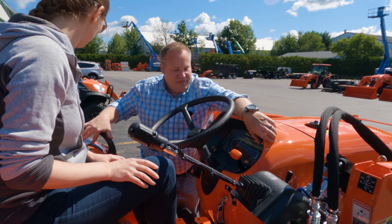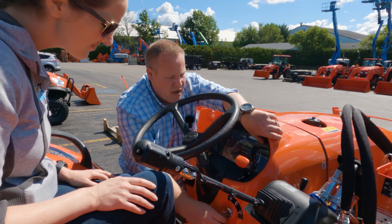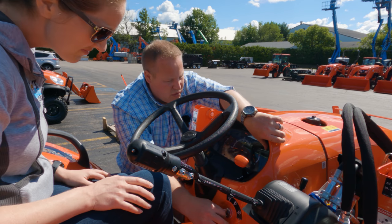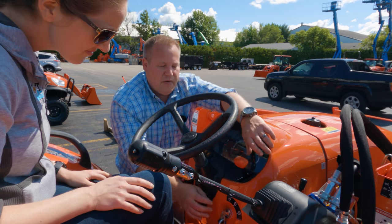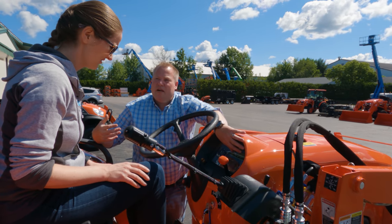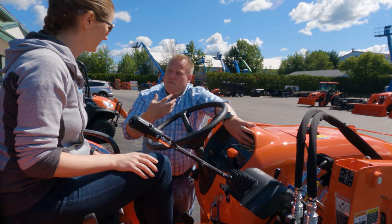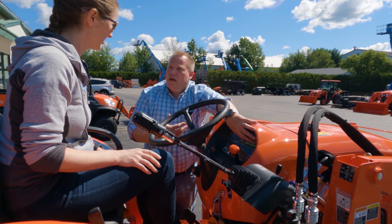When the smoke light and the arrow light come on, that arrow is telling you to bring up your RPMs — bring them up to around 2500 RPM. At that point you can still use and work your tractor; it's just going to be burning off the soot and debris from inside your can as you work. Some people don't like to run at 2500 RPM — you can let it sit if you want to, but you can keep on working. After about five or ten minutes, depending on temperatures and debris, the lights will just turn right off.